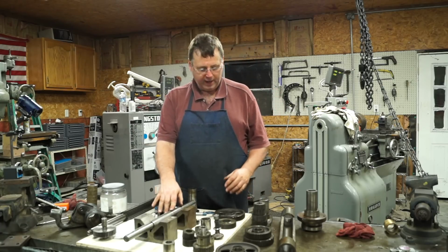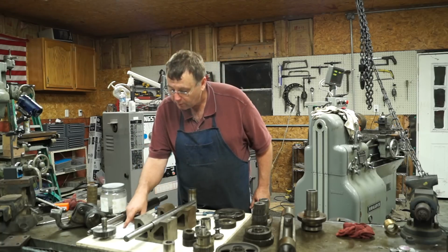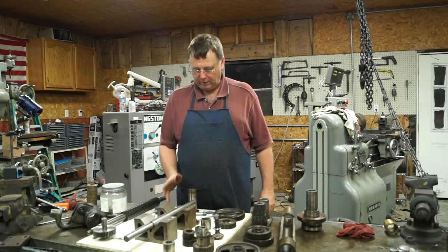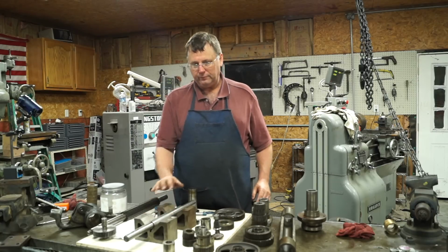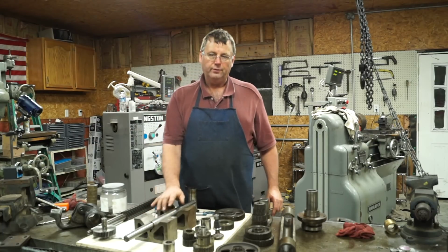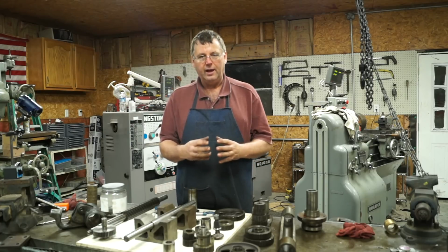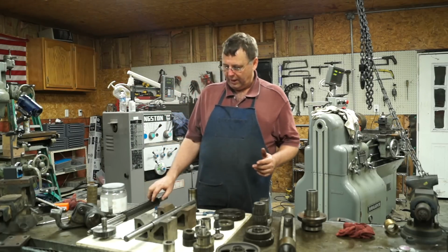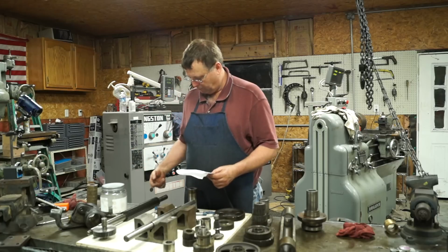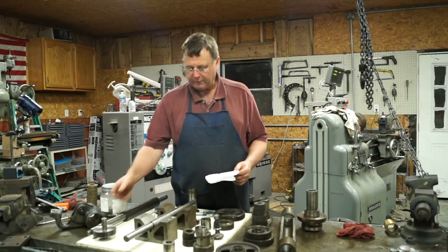Basically, for the shaft for the gear set, we had 4 thousandths clearance on this end and 4 thousandths clearance on this end in the bearing. Okay, the gear to shaft clearance, we had 4/10. So there's 4/10 clearance, so they should slide on. And that was kind of rough getting them off. So maybe we'll get lucky and it'll just slide back together. The drive gear that drives the gears, this end here we had 1.5 thousandths clearance, and this end we had 3 thousandths clearance.